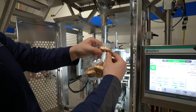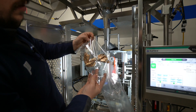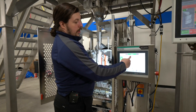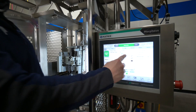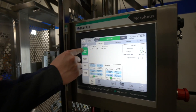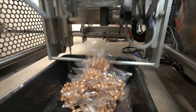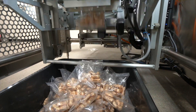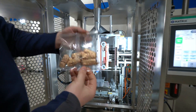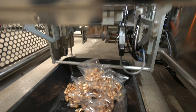Some of them might make it but some won't, and that's where you'll get bags like this one. I can increase this a little bit — we'll go up to 20, so an extra 200 milliseconds — and let's try that. You can see how the product perfectly landed right in the bottom of the bag where the jaws close, so every bag no matter what speed is going to be clean with no product in the seal.